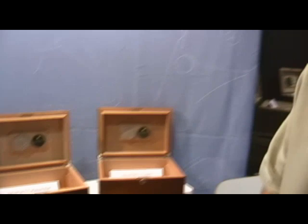You can probably see it by moving the camera. So our challenge has been to meet with manufacturers, sit down with them, explain choosing the correct veneers at market, how to apply them correctly, how to grain match, how to clear coat rather than stain. And most importantly, we have a process of hand rubbing — we do a hand rub finish between each layer of the finish on the box. What that does is make sure that the light is refracting accurately, so when the light hits the box and comes back to your eyes, you're actually seeing what the grain looks like rather than what the stain looks like.